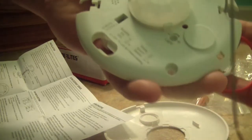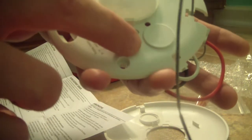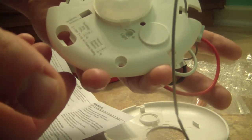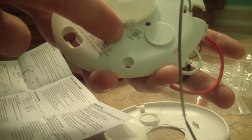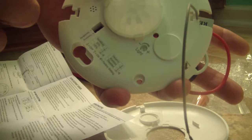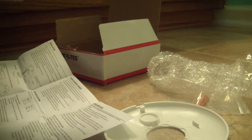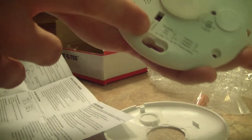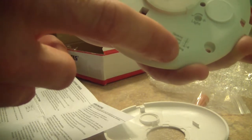There are some settings on here. There's a light sensitivity setting you can turn to where it needs more light or less light in the room to turn on — so you don't want it turning on when it's bright outside. Mine's in a closet so it doesn't get that much light anyway, so it'll probably be on the highest setting. The time setting controls how long it leaves the circuit energized once activated — I'm going to set that to around five minutes since we typically breeze in, grab our clothes, and breeze out.